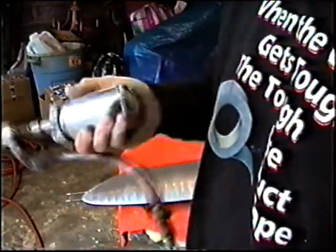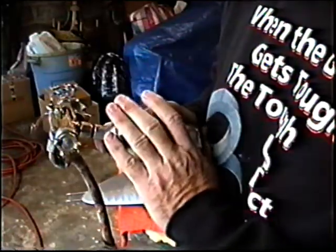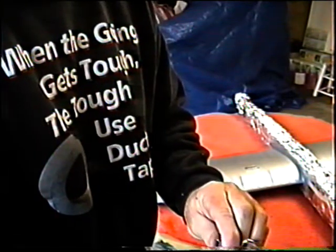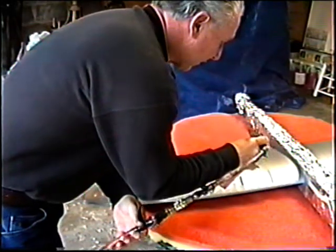Even if you're painting in cold weather, leave the paint and the gun in the house, and let the paint be warm. It's under 30 degrees out here. It is really cold. This is why I always like to do that little test first before I come running out here, especially when you're trying to spray with low pressure. And I just want to touch up those little areas.